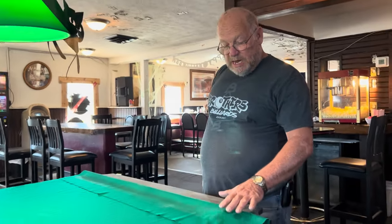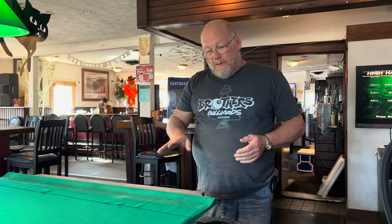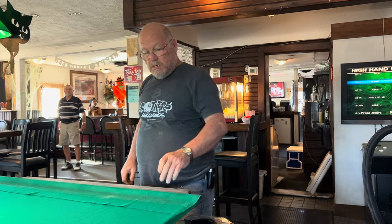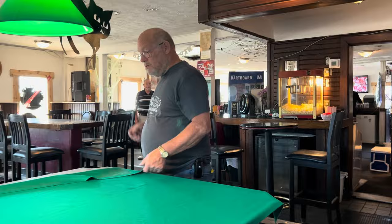The mistake everybody makes is trying to stick the glue too soon. When it feels like this, and you can see the glue moving, it's too soon. You gotta wait until the stickiness feels like duct tape, so that when you pull your fingers away, it really wants to grab onto your fingers, but the glue isn't coming with it. This glue is not designed to stick on each other on two sides wet. You gotta wait until it's like duct tape and duct tape, and then you put the two together. That's good. So, give it a few minutes to get dry first.